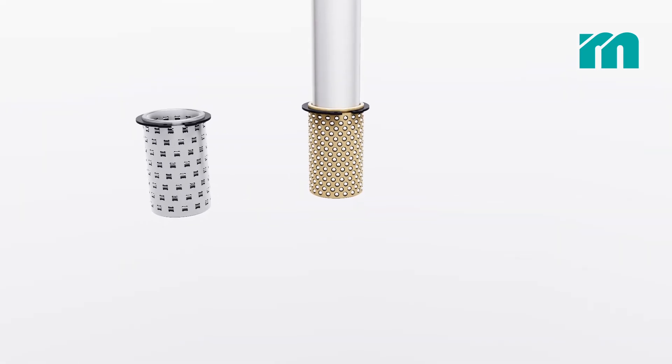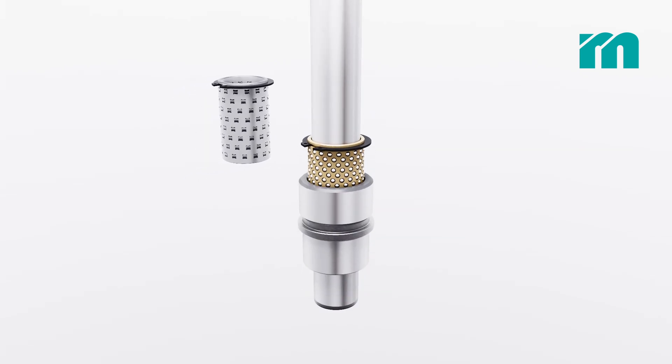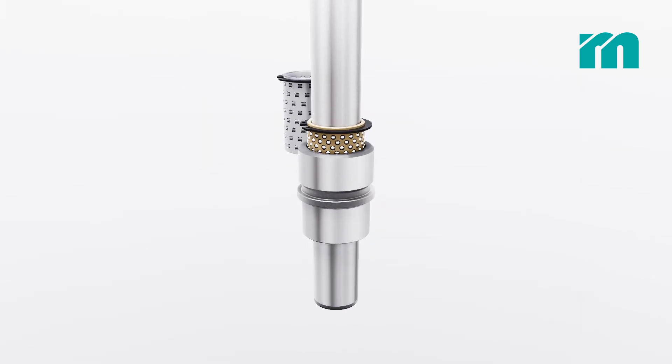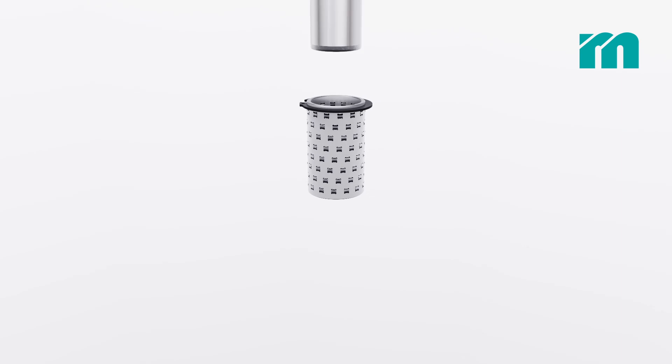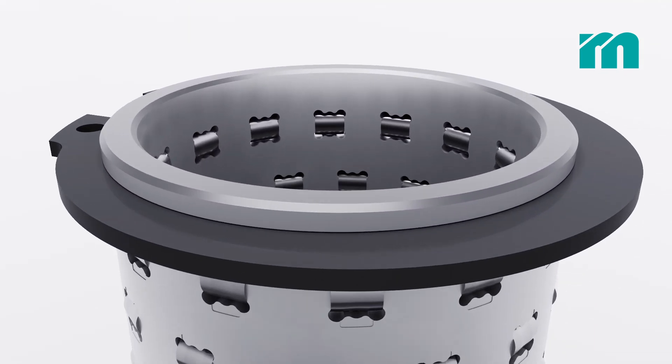You can choose between interchangeable ball and roller cages. The ball guiding bush is suitable for a maximum number of strokes. The use of roller cages is recommended in case of higher shear forces and high precision requirements in the die.